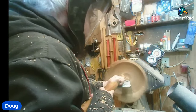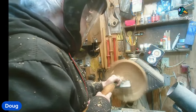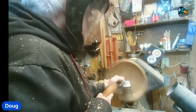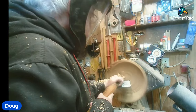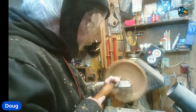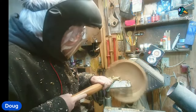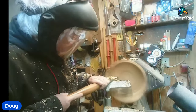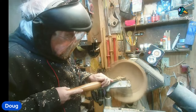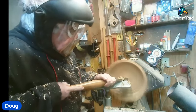And Peter says he uses a curve tool rest, and I do find that those help significantly. That's something else I can't get away with. I've heard both. Some people say it's the greatest thing, and others don't. I went out and specifically bought, I think it was a Robust curve tool rest, and I still can't get away with them, probably because of the type of cut I'm wanting to do. Well, I made mine and it goes straight for a ways and then it curves into the center. What I tend to find is when I'm using the curved tool rest, I'm okay going down the edge of the bowl. But once I get around to the bottom of the bowl,